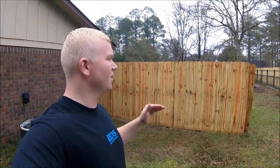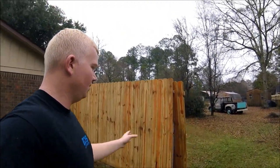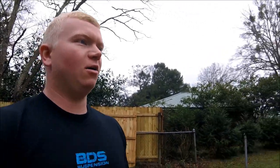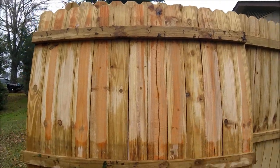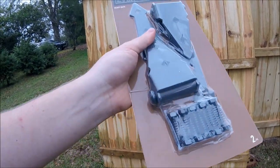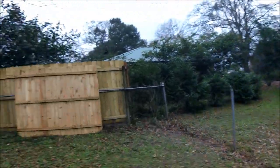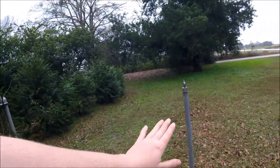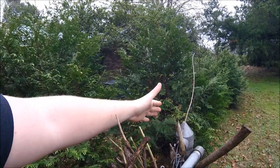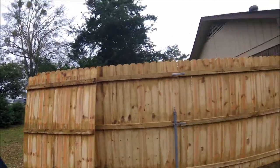Now that I've got the first two pieces in place and measured my lawnmower, I decided to make this gate about 54 inches wide - pretty wide, but it would be nice to drive a four-wheeler or lawnmower through. I went ahead and cut a 54-inch wide section. I bought these hinges from Home Depot - a good deal for two of them, and they already come with pretty beefy screws. A full eight-foot section will go right here with this pole in the middle to support it, and then another eight-foot section starts here. I'll cut off the excess, which will actually fit pretty well in one of the spots on the other side.